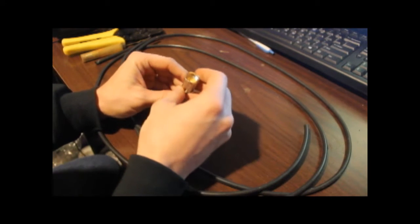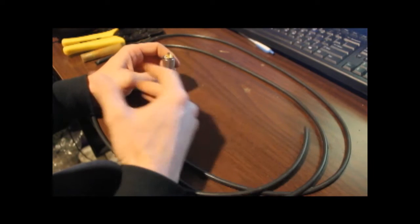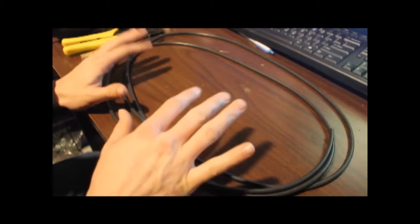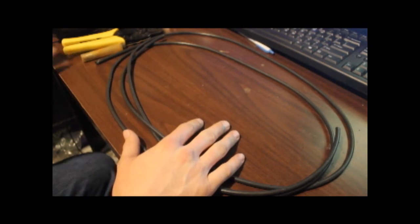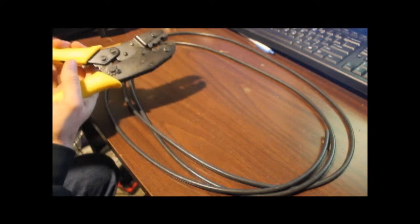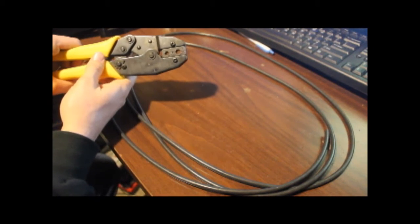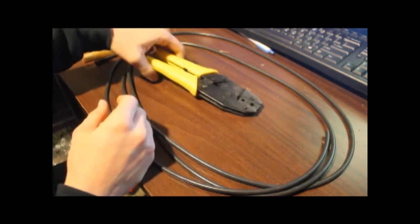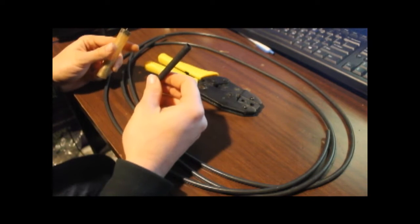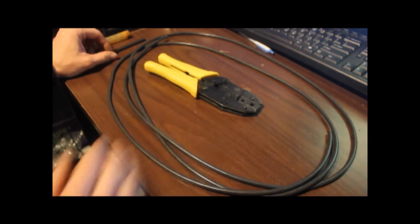I personally don't really like these type of connectors. For me there's a lot of work involved. A lot of other people may have a good way to do it and it works for them, but what works for me is using crimp-on connectors with a ratcheting crimp-on tool. It'll crimp the collar onto the coax cable, making a nice tight bond, then you solder the center conductor and heat shrink the outside to give a little stress relief.